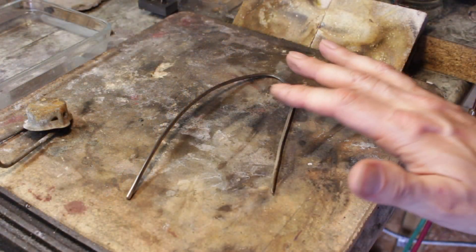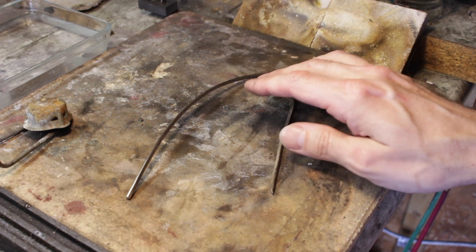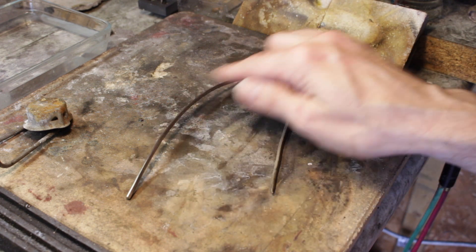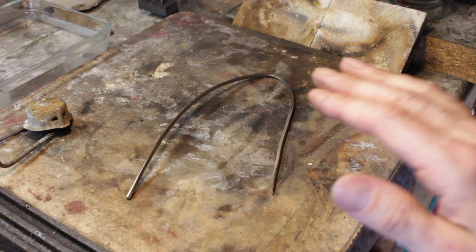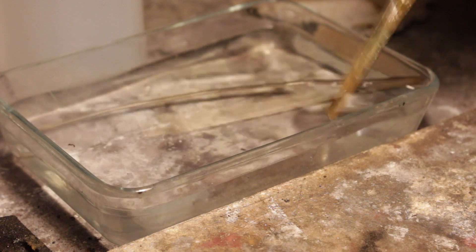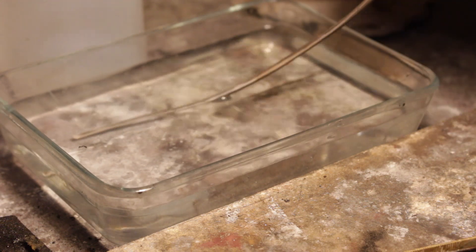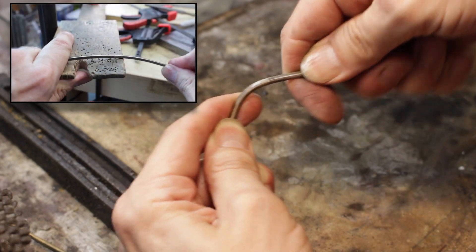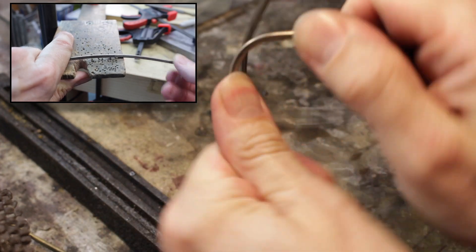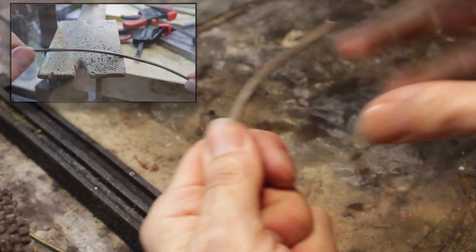If it's glowing red in bright daylight, it will be way too hot. Let the metal air cool for just a few seconds to what's called black heat — the metal isn't glowing anymore, even with the light off it's black, but it's still very, very hot. Use a pair of metal tongs, pick it up and quench in water — this is just regular room temperature tap water. If you want to pickle it you can, but only after you've quenched it. Comparing it now to before, the springiness has gone, it's much easier to bend, and I can now continue rolling it without any fear of it cracking.